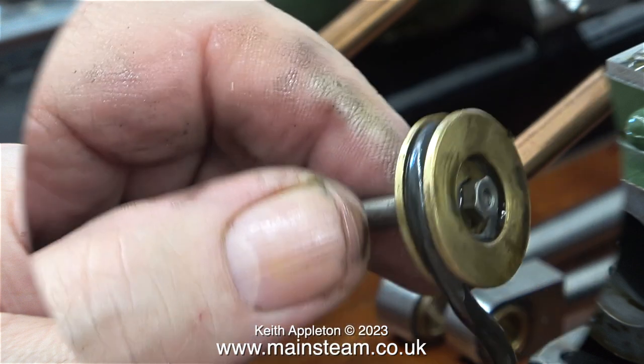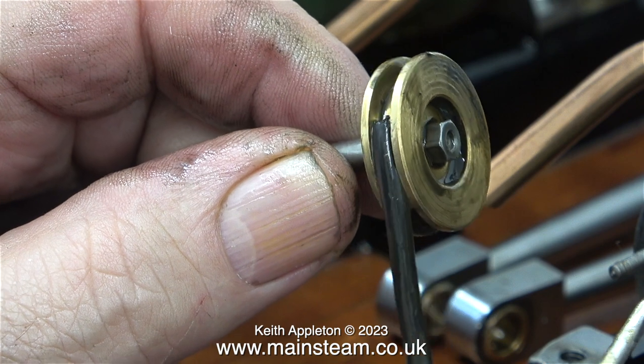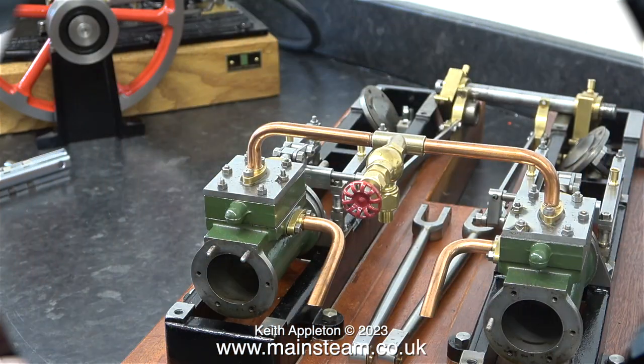On this side, I just chopped off the piston ring, and as I unwind it from the piston, you can see that it's too large a diameter and it's too wide. I really do think it may be down to swelling because of the type of oil being used. Some oils do contain additives that attack certain types of rubber.